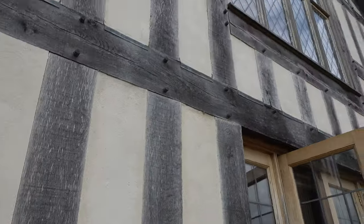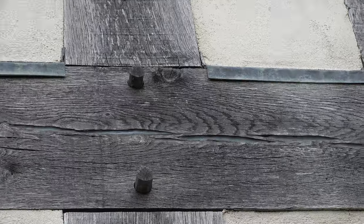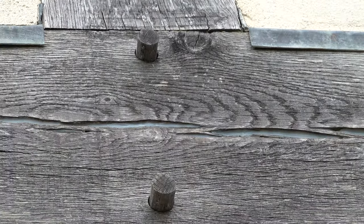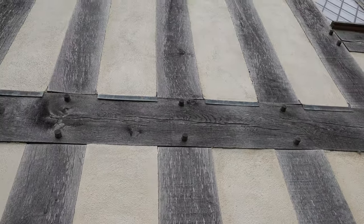If you look up there you'll see there are shakes in the timber, and even the shakes they've tried to fill with silicone — absolutely the last worst thing you could do. You do not fill shakes in the timber because once water gets in it can't get out.